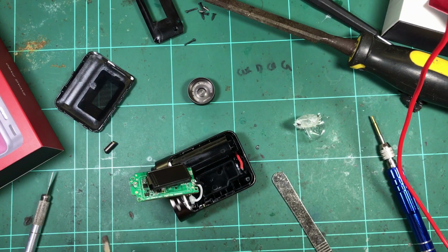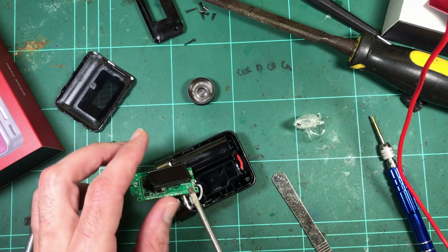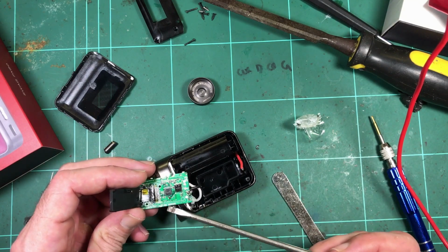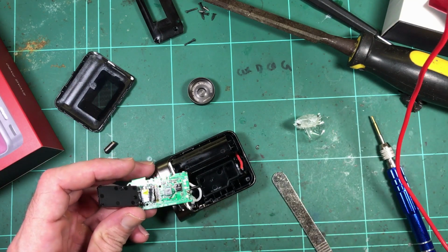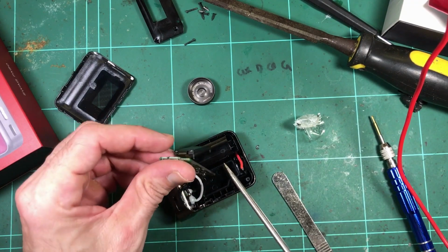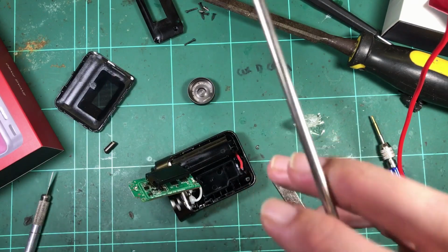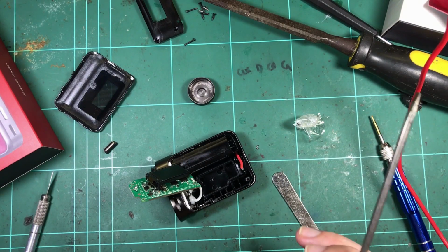And they're simple to implement. There's just not many components, because literally all you need is one or two MOSFETs and something to control it, and you're good as gold. There's not a whole lot going on, and you don't have to filter it. You just put those pulses straight to the coil, and you're good.